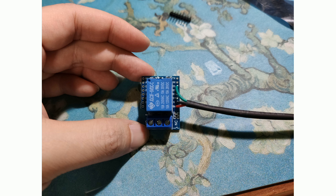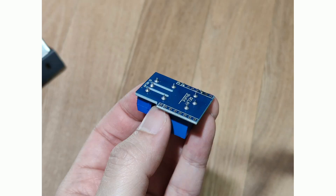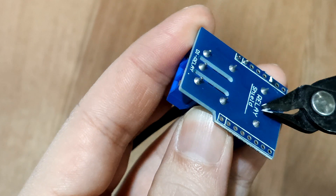This is how the Wemos D1 Mini relay shield looks. I soldered three wires to the 5V power, ground, and D1 pins, then wrapped the three wires with a heat shrink tube for extra protection. After soldering, I applied some hot glue to the joint between the wires and pins because I didn't want the connection to fail too soon. Looking at the bottom part, the ends of the pins are quite sharp, so I was worried they could short out with the metal casing of the PSU. I used some pliers and cut off the sharp ends.